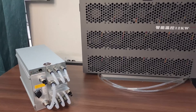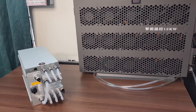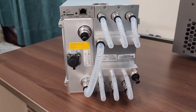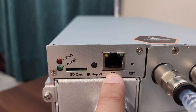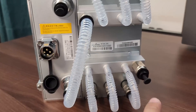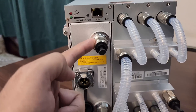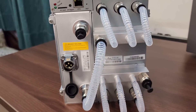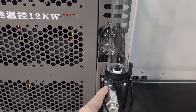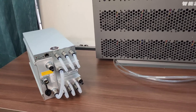On the right side we have our 12 kilowatt radiator. I will show you everything — how the piping connections work and how the electricity fitting is done for this machine. The front profile is where we connect the ethernet cable, the power supply socket, and the water inlet/outlet. Hot water comes out and goes into the radiator, which cools it down, and the cool water is pumped back into the machine.